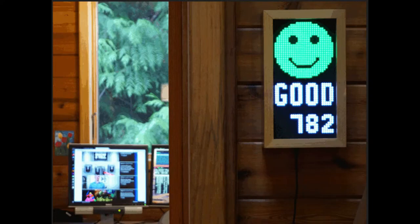The Matrix Portal CO2 detector is very simple — it shows a few words like good, bad, warn, and the number which is the CO2 level, in this case 782 parts per million, plus a happy or frowny face. But one thing that's not so awesome about the SCD-30 is it's kind of big and it's through-hole soldering, so it's not easy to embed in small electronics or to automate production.